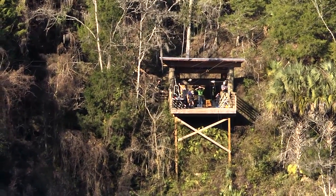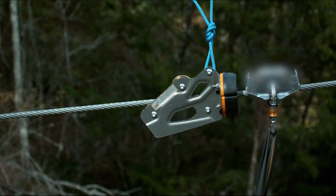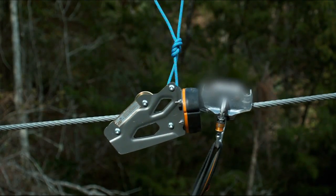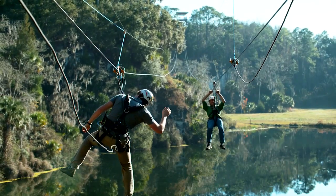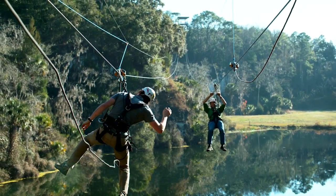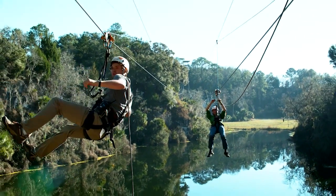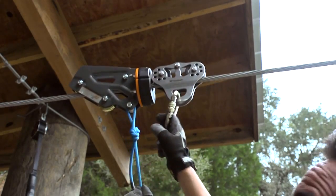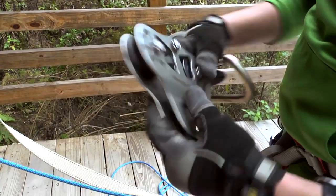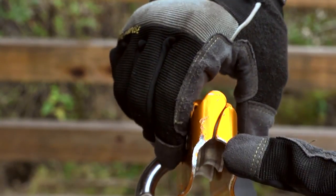When a competing trolley collides with a brake trolley in a high-speed braking scenario, many things happen that are invisible to the unaided eye. When slowed down, however, you can see that most trolleys make contact with the brake trolley and immediately rack up, scraping against the cable. This not only wears out your rider trolley and zipline cable, but also makes for a more jarring and uncomfortable experience for your rider. Many rider trolleys also have a large hole for the carabiner, which allows it to bounce and scrape up the rider trolley, and two sharp leading edges that tear up the brake trolley. As you can see, there is a lot of damage and wear to these trolleys caused by impact braking.